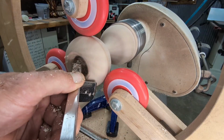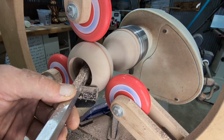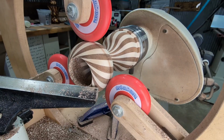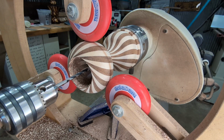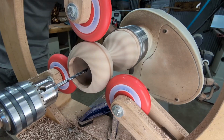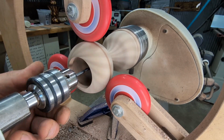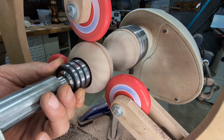I'm planning on filling the rattle with copper BBs. Copper is a safe metal. I don't want to fill the one end right away, so I am going to core out the handle to allow the BBs to pass from one side of the rattle to the other side, and maybe even create a rain stick type sound effect. We'll see at the end.